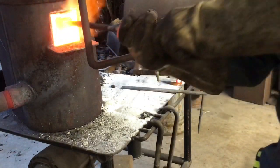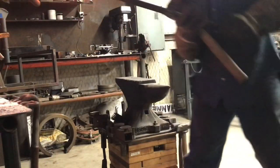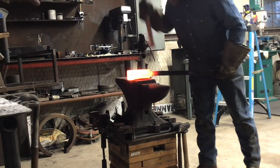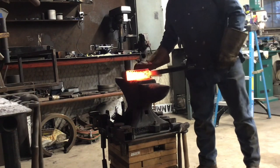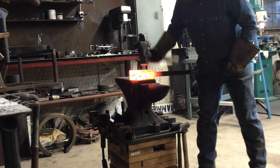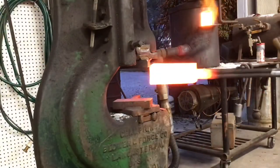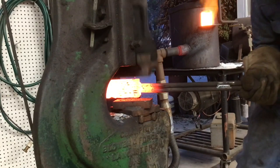I'm going to do one side, let that flux melt a little bit and get down in the billet, then flip it over and put some on the other side. First thing we're going to do is set the welds — always do that on the anvil with the six-pound sledge, working through the middle of the billet first and then around the edges. The main thing, even if you're going to use a power hammer or a press, is to do it quickly and get it back in the forge. After that I'll bring it out one more time to clean off all that flux, then it's over to the power hammer and press. I like starting on the power hammer because it's a little lighter duty on the billet.